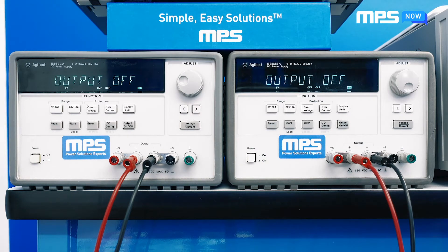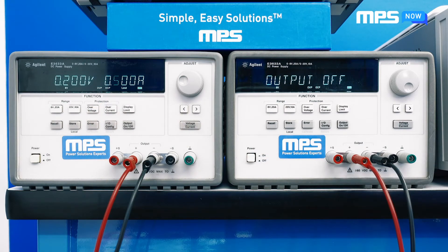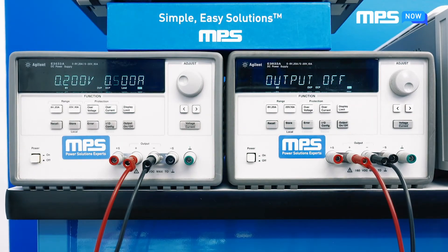The MP1528 is designed to use a DC voltage or a PWM signal to control the brightness. For this test, we'll be using a DC voltage between 0.2 and 1.2 volts along with the low input current limit. If you're using a PWM signal, be sure to set the minimum voltage less than 0.18 volts, the maximum voltage over 1.2 volts, and the signal frequency between 100 and 400 hertz.